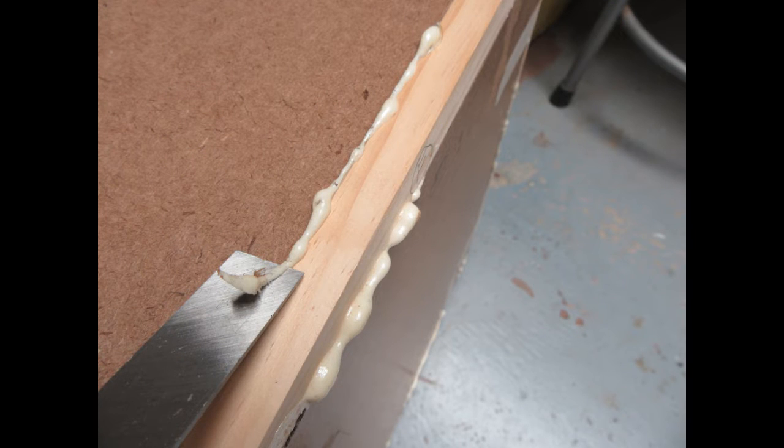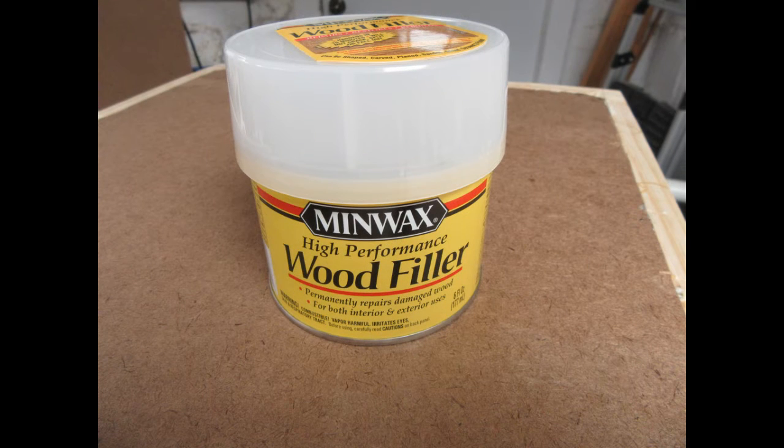After the glue has completely set, a chisel is used to remove excess foamed glue from the panel seams. Not shown in the photos, at this time I used a belt sander to carefully sand down the pine frame to match the level of the inlaid masonite panels. There will inevitably be some gaps in the seams and at the corners, and also some routing mistakes that need to be filled before proceeding.